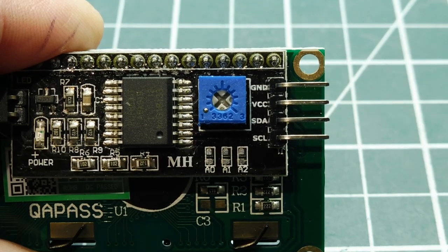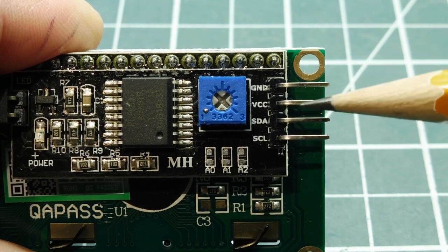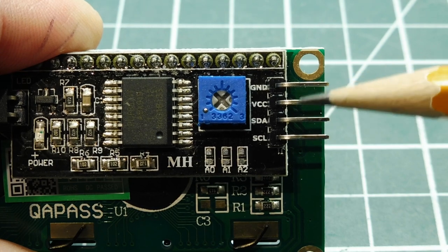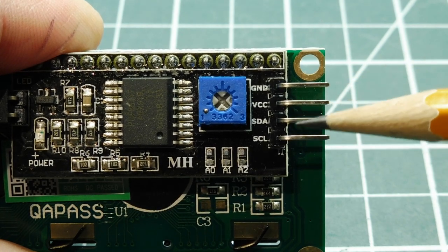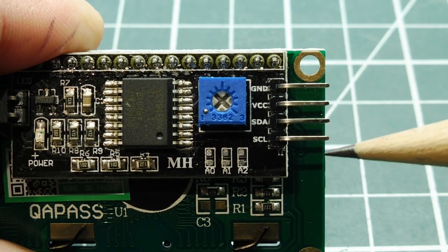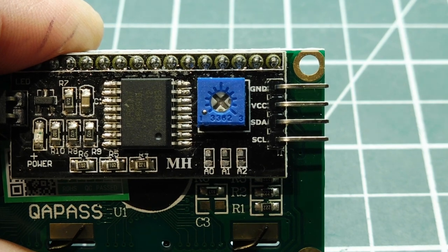Here are the four pins on the I2C piggyback board that we use to connect to the SCAMP3 board. We have ground — that's a common ground. We have VCC, which is 5 volts. Then we have SDA, the data line, and SCL, the clock line — those two are the I2C bus. We hook up these four lines to the SCAMP3 board and then we can drive the LCD 1602 display.